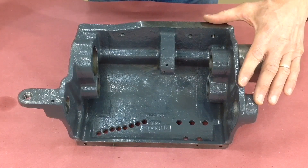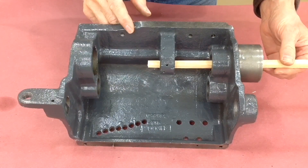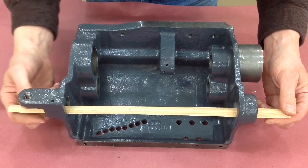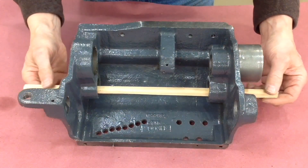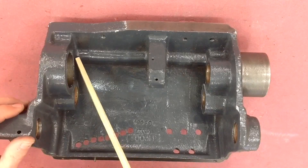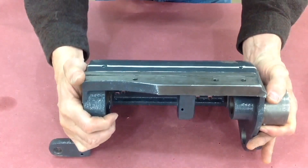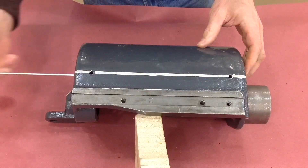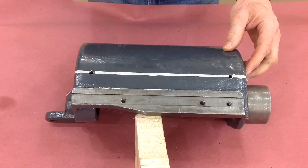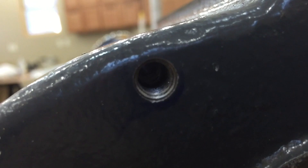This is the casting with all the parts removed and I just freshly painted it. You can see here is where the main power shaft comes in with bronze bushings on either side. Here is where the tumbler shaft goes, then there is the cone gear shaft, and then finally the lead screw comes out the back supported by two thrust bearings. There's a protrusion here in the casting for the oil reserve or oil gallery. Here I put tape on the outside of the casting so you can see where this gallery is — it's a hole through the casting with two holes on top for the oilers.